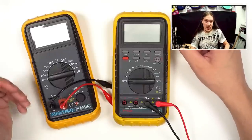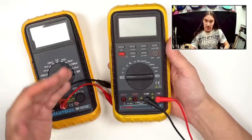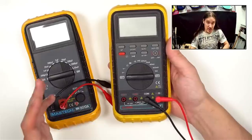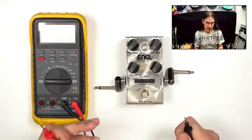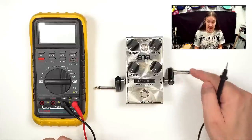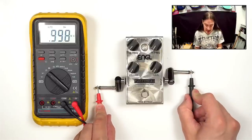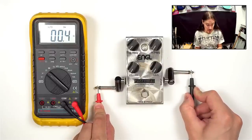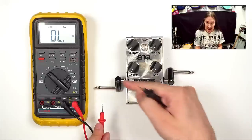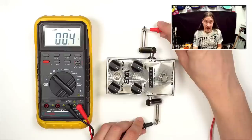Now let's talk about the other method, which I usually use in my videos. For that you're going to need a multimeter — a device used to measure different things in electronic circuits. I have two of them: one to measure resistance and one to measure capacitance. The first part is actually very similar to the previous test, with the only difference that instead of guitar sound we'll be passing electricity through the pedal and measuring the resistance between the input and the output when the pedal is disengaged. If it is zero or close to zero — meaning the signal simply passes through — that means the pedal has a passive bypass, possibly true bypass. Otherwise it is an active or buffered bypass.